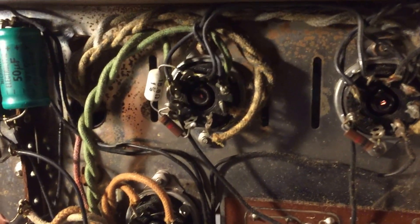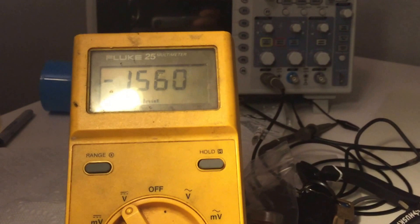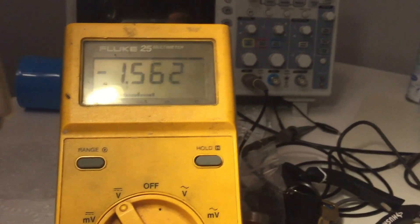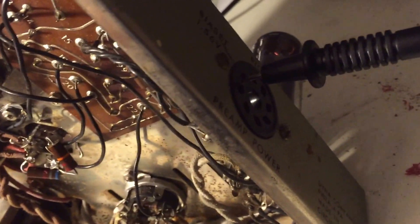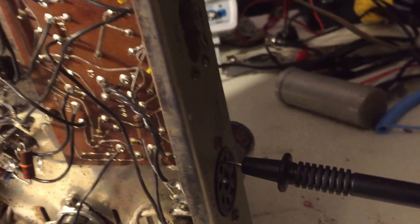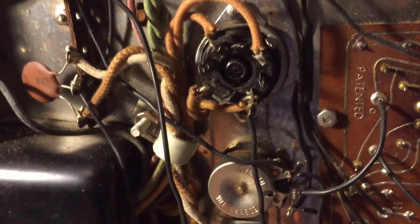I'm re-measuring all voltages now that the system is fully loaded. As I increased the voltage, the bias voltages naturally shifted — I'm now getting 1.56 volts on one side, with a lower reading on the other. I'm dialing that back to 1.4 volts, which is our official voltage measurement setting for this unit. It's also worth waiting for everything to warm up, because these voltages do change — the rectifier goes high, then drops, then comes back up as everything turns on. Everything is working as expected.